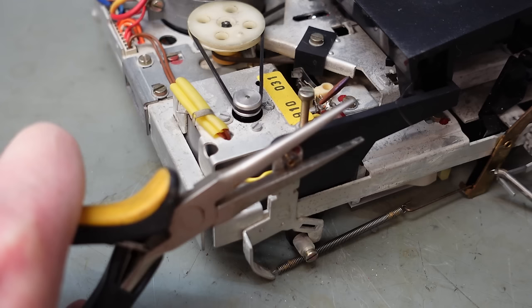And we can see the VU meter still dancing away. Well, that problem hasn't fixed itself. And it's probably not a faulty VU meter looking at that. The output's rather noisy. Give it a dry test for no tape. Oh, we got noise. Just going to put a tape in it so it doesn't keep stopping. Press eject. Oh, it's still cutting out. Why is that? Try again. Looks like it's working.